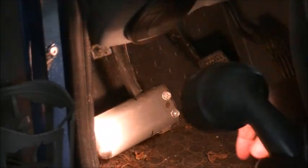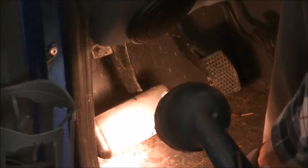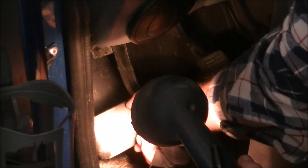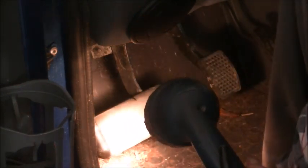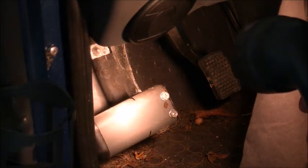Now, you guys don't have treadmill handles, but you can go over to Home Depot or something and buy — I believe it's an eighth inch or a quarter inch flat stock in short pieces, pretty close to that wide. I think you can get them as much as two inches, and that'll work just fine. Cut it off, drill some holes, and put it on there. You can buy that anti-skid over at Home Depot too. So let me get that on — I'll show you that when I'm done, and that'll be the end of this project.